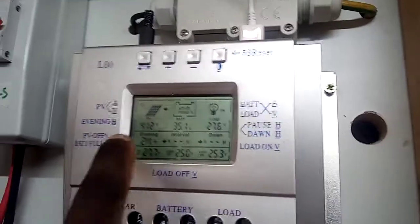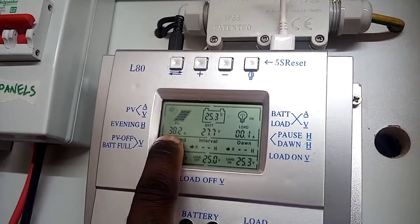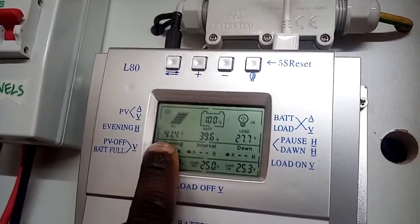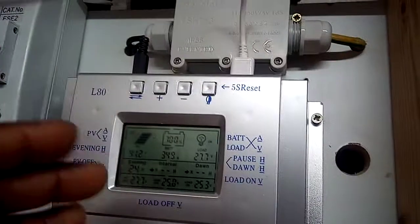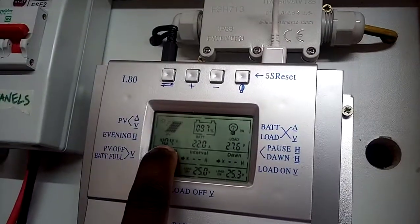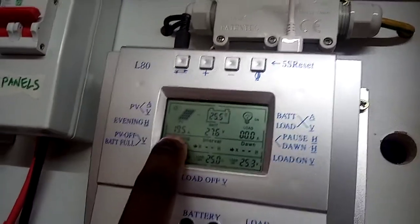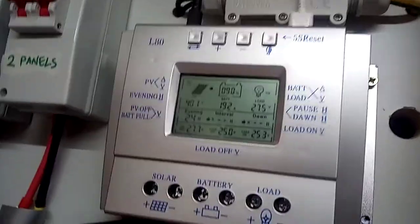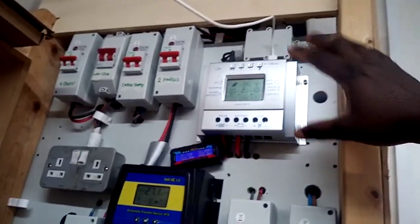On the top left you can see the PV voltage and the amps — right now 39, 38.2 amps. The battery voltage is showing 41.4V on top, and then 40 amps, 40.1 amps. It's fluctuating as clouds come and go — now it's 34.3 amps. This goes up to 45 because of the number of panels and the high voltage and amps. Each panel is 400 watts, so it's a good MPPT controller, it's working fine.